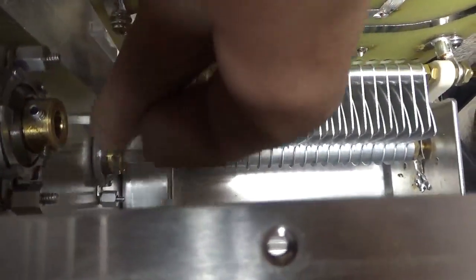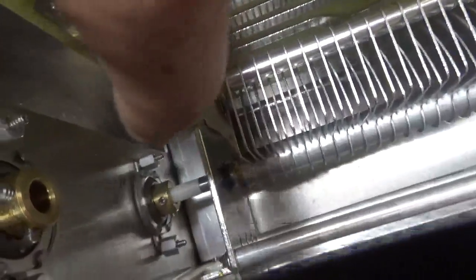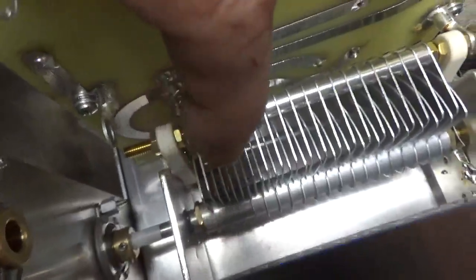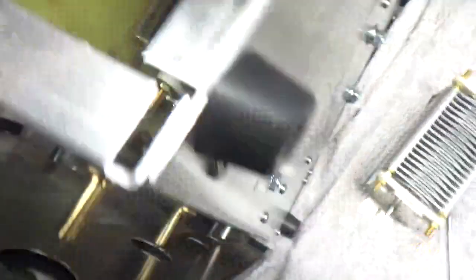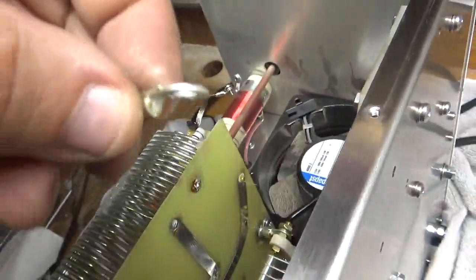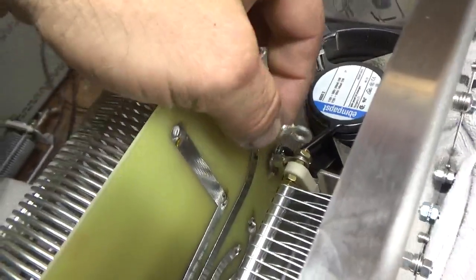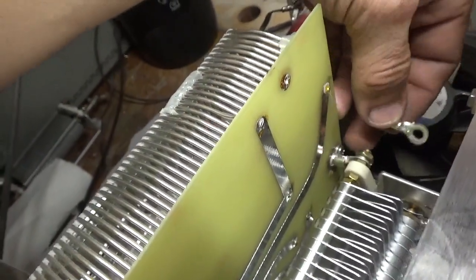There are two set screws that go through those two standoffs — they use them as nuts. You loosen those two set screws — don't pull them all the way out — just loosen them enough so the vernier drive will slip back and forth. Put the air variable in, put the back screw back through, tighten these two screws really tight. Then tighten the two Allen screws on the vernier drive, and re-tighten those two Phillips screws on the outside. Then I put the connection facing this way, slip it back on, lift the board up, put it through the hole, solder everything really well. I put the nut on to hold it in place, solder everything really well, then tighten up on the nut.